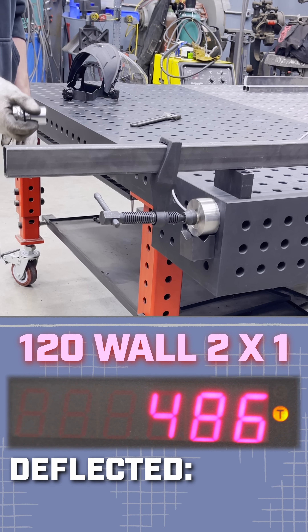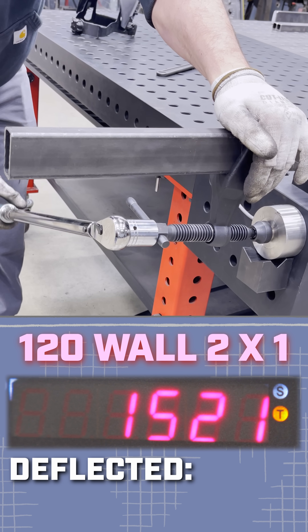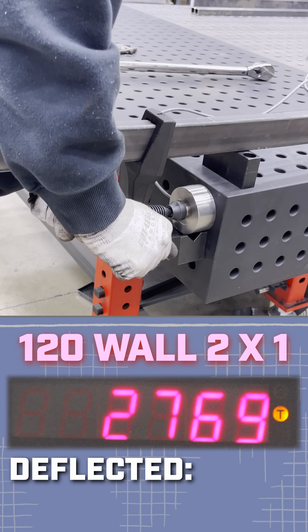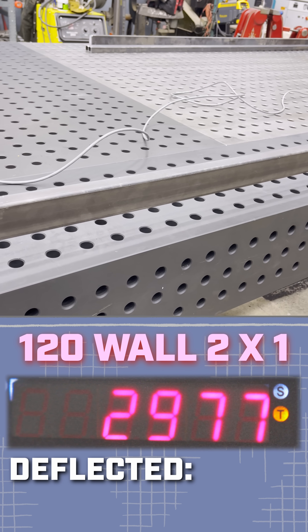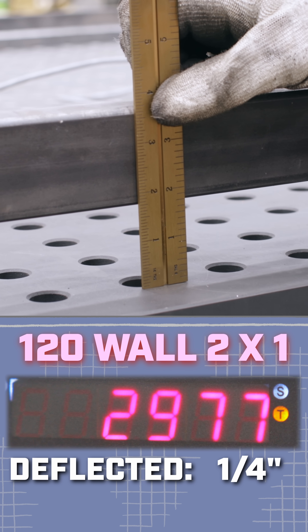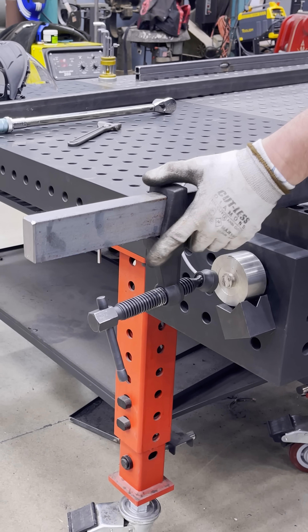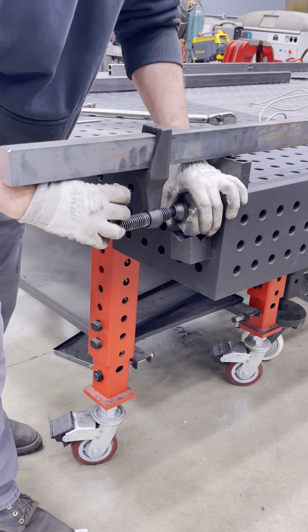Just by hand that was 400 to 500 pounds. Then 1200, 1600, 2000, 2730 — I can still turn it more by hand and we're sitting at 3,000 pounds. Very little bend. Inch and three quarter, so it's deflected a quarter of an inch. Solid one by two bar stock — I'd only want to use this in rare occasions where maximum clamping force is desired.